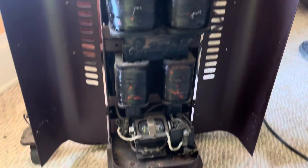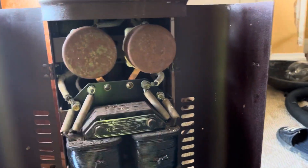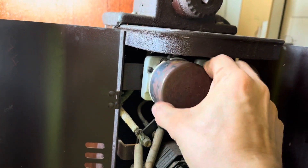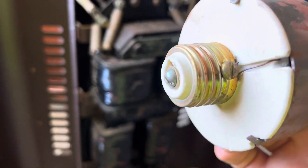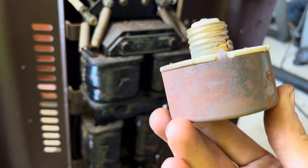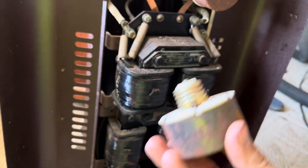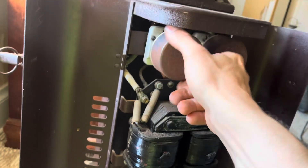It sounds just like the RF fixtures - the ballast is somewhat similar. It's got these nichrome resistor packs; you can see the nichrome wire, could be iron as old as it is. I megged these out and they both have the same resistance. They get kind of warm when they've been used. I've been running this thing trying to get the voltage settings right, but they're replaceable so I assume they wear out.